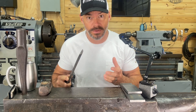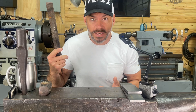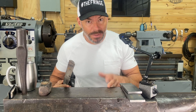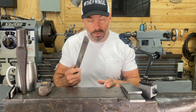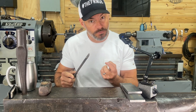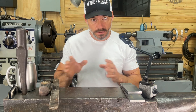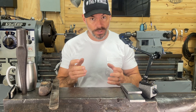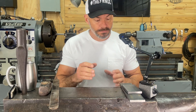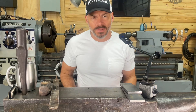If it's got rust, dirt, or grease in that pipe, hit it with a file just to knock it out real quick — it doesn't have to be perfect, just disturb it. That flux will float that stuff away. The flux on these welding rods is bad to the bone — take advantage of it. We are welders, not grinders. I hope that helps somebody. Stop grinding mill scale, just be a welder. Hope y'all have an awesome day — later!